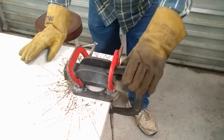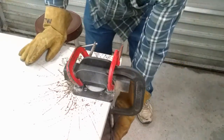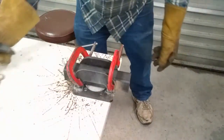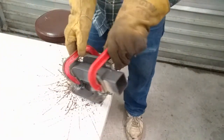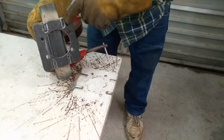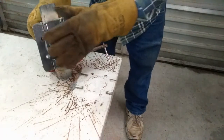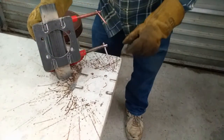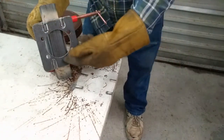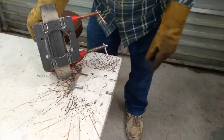After tacking all four corners all the way around, remove the assembly from the table but keep the two clamps on. Now weld down the face plate — weld about three-quarters of the way down, though welding all the way around gives a good weld. You can always grind off a little bit so the bearing sits flat against the face again.